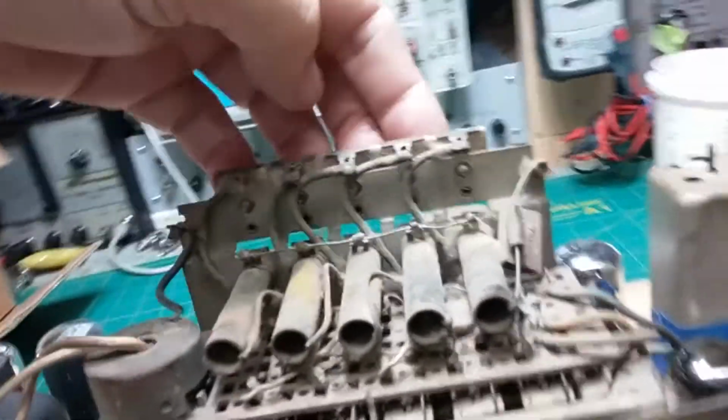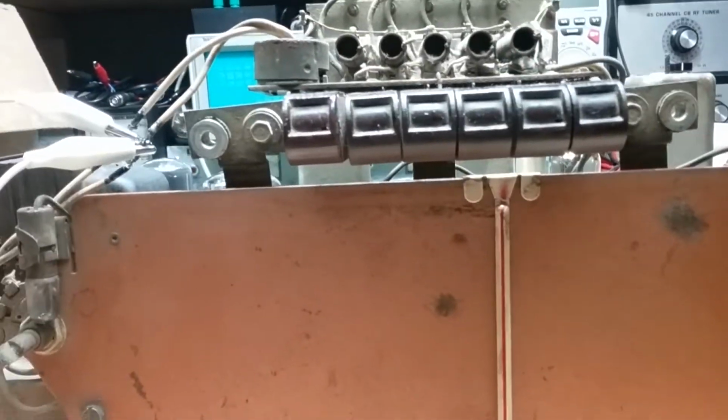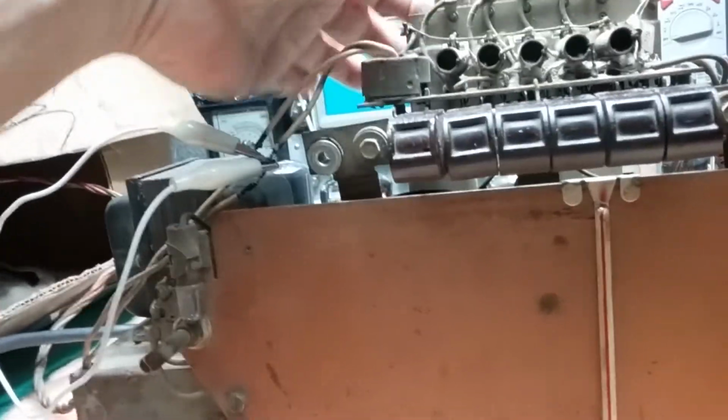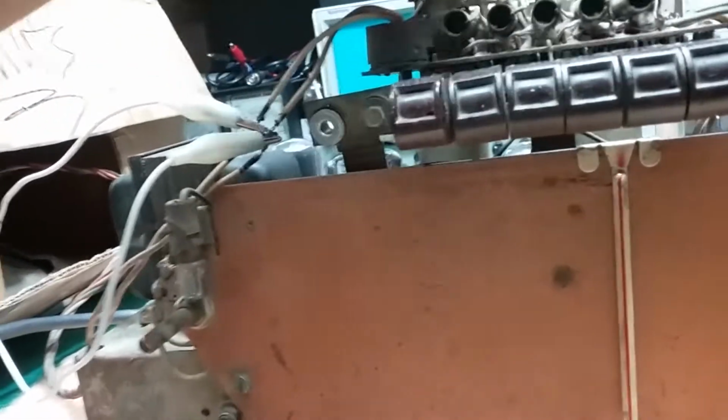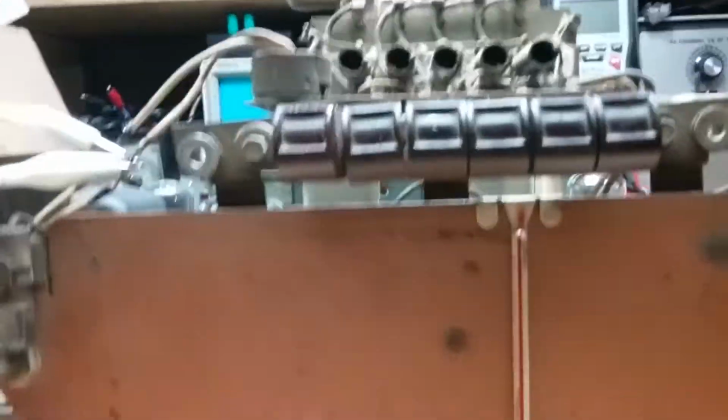There. So those tuning controls, you actually use a screwdriver and set each one for the frequency you want. That's not a big deal, and you can do that from the back of the radio, obviously. You can push a button in and then tune the first one to where you want it. Push the next button in, and from the back of the radio, tune the next one you want, because the back's open. But we got to get it working.